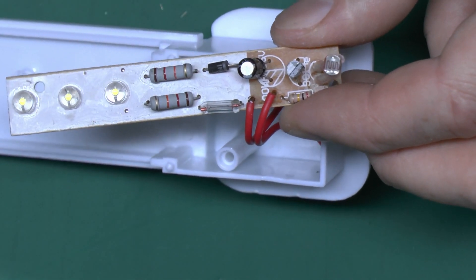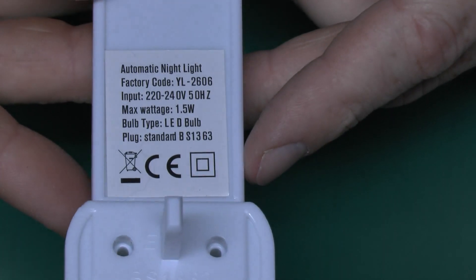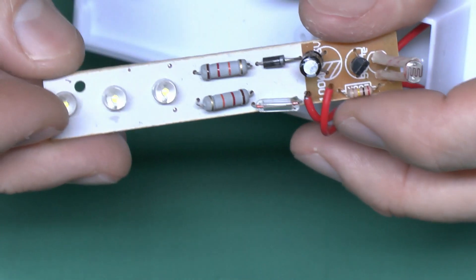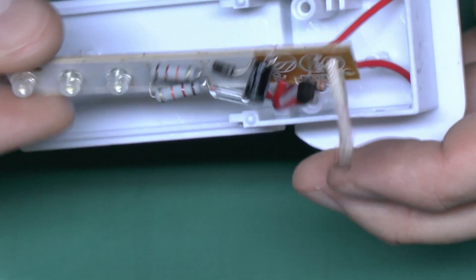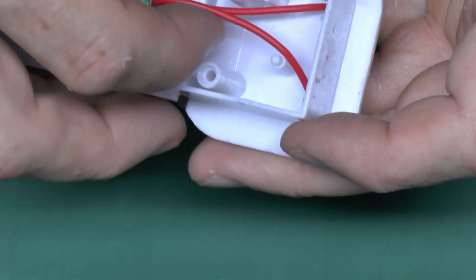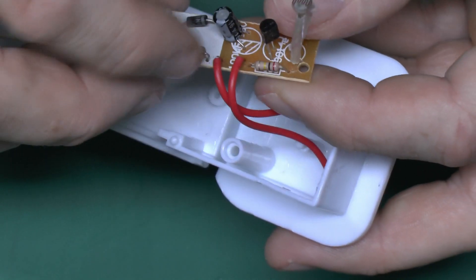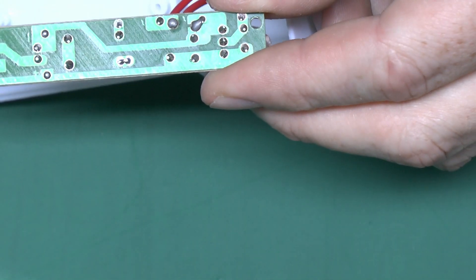The power they're going to be supplied with is going to be incredibly choppy — it's only a single diode and a capacitor. Obviously most of the voltage reduction is done by the two larger resistors here, which is where most of the power consumption is going to be as well. This thing on the back did claim a consumption of 1.5 watts. If you think these were half-watt LEDs, well think again — they're probably not, and it's probably most of the power that's on these two resistors. The other problem with this device is the wires here, which are totally unfused — any short or damage there is going to cause a bit of fire. So they have at least put a fuse on the board. Clearances-wise it's pretty poor — probably just about marginal.